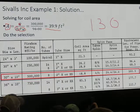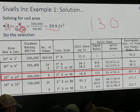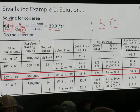Okay, let's think about it a little bit, maybe together. If I use less temperature in the bath, log mean temperature difference, T sub M, will be less, right? When T sub M is less, A will be more. So if I don't want water in the bath that hot, I need more area to compensate for that. You see what I'm saying? If I use the water in the bath very hot, I may need just less area of the coil.